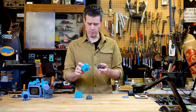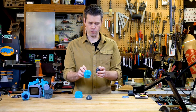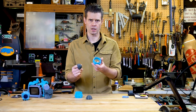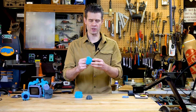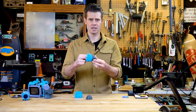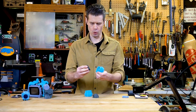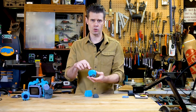I have run into a little bit of a problem here. I think I either had my measurements a little bit off when I was modeling these two parts, or I didn't account for a little bit of expansion on the different materials, because these are the shoulder sockets that are supposed to be held in place just by friction. It's supposed to be a press fit, but that's not going to work. These are meant to only come in from one side but they're going in from either side and pulling out. So I am going to have to fix that using a bead of Sugru along the inside.